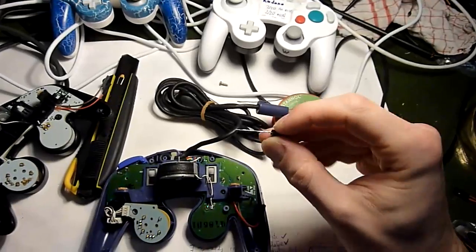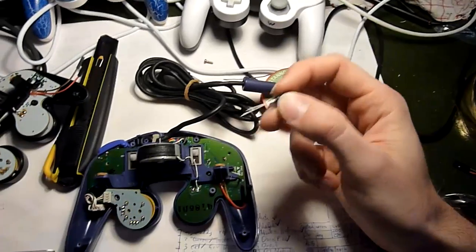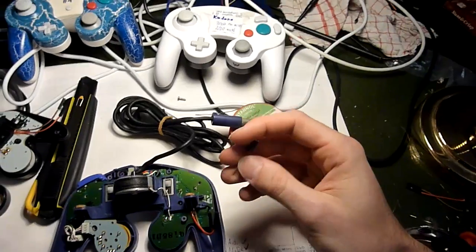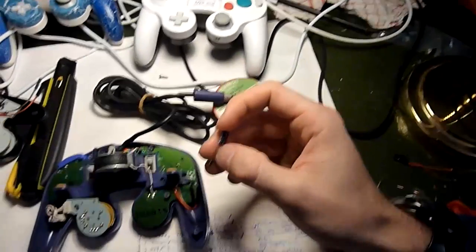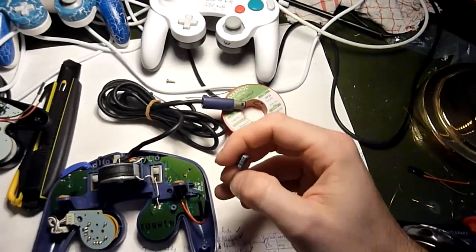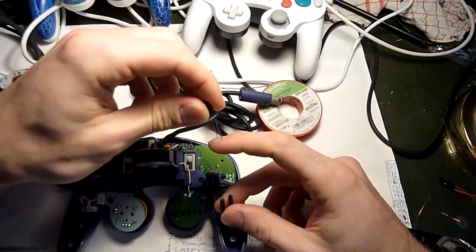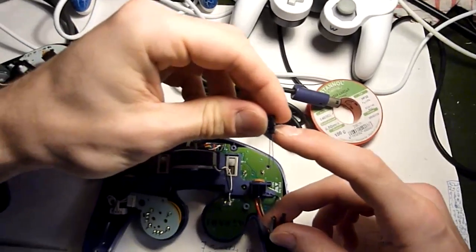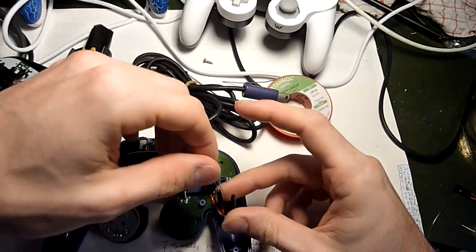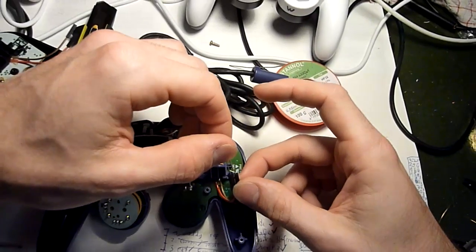Inserting an electrolytic capacitor with the wrong polarity will not only break the capacitor, but also cause misinputs where it will respond slowly and maybe not dash but only walk. So yeah, it's really important that if you use an electrolytic capacitor, that you put it in with the correct orientation. Once more, that means that the longer leg without the gray stripe goes into the red wire that is connected to pin 2, the middle one, and the shorter wire with the gray stripe is connected to the brown wire here, which is connected to pin 3, the ground one.